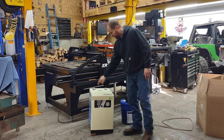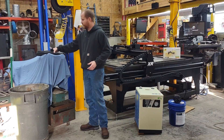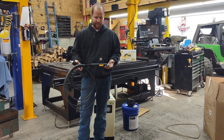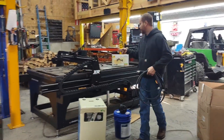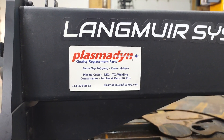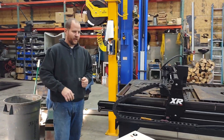So the air flow plan will be: air compressor to the refrigerated dryer, then the Motor Guard filter, and then to the plasma cutter itself. The last thing I have — I have that Razorweld Cut 45 and I bought this manual torch for it, which is great because you can turn your CNC plasma cutter into a manual cutter. It's a multi-use tool. I got this from Plasmadine — it's a local Missouri company right out of Pacific, Missouri. They have great products. I really like this torch. I've used it quite a bit so far and I'm really happy with it.